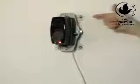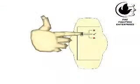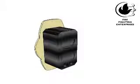Now, move the mode switch to the middle position, which is alignment mode. In alignment mode, you are centering the beam detector on the reflector and the beam detector is adjusting its power for optimum signal. The LEDs now mean something different. A red LED means that you are gaining signal, and an amber LED means that you are losing signal.